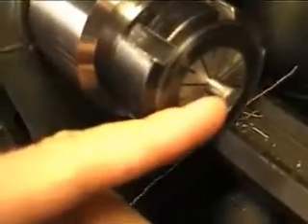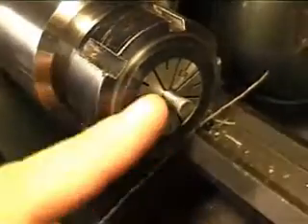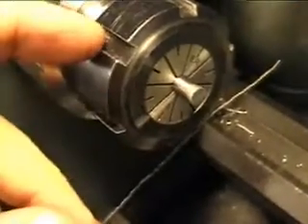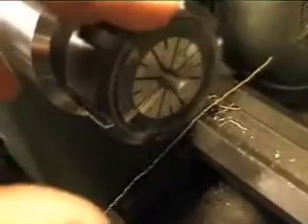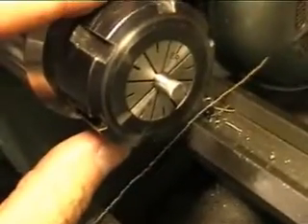If you try to turn a valve pin and you use your 3-jaw chuck, then you won't be able to unclamp and clamp it back again and get it to run true. Well, maybe you can, but I can't. So that's why I use my collet chuck.